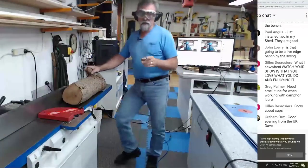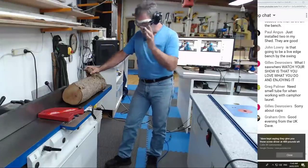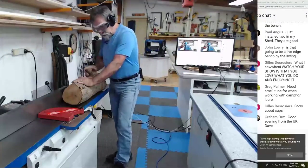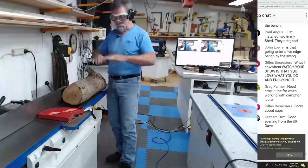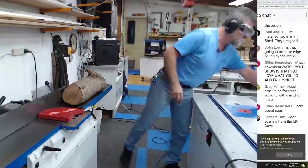The main thing is, when you're doing it this method, you set the cut down to about 3 millimeters or 1/8 of an inch. You hold it on the top. Make sure that you've got an arc like this of some sort. Don't put a belly that way. Same as doing any thicknessing. I'm going to turn this off for a second.